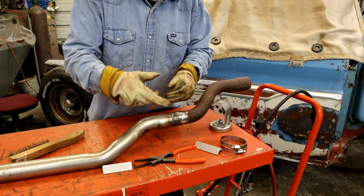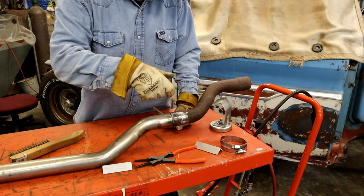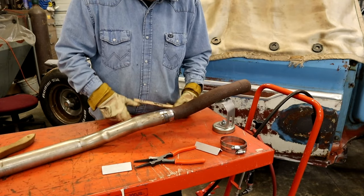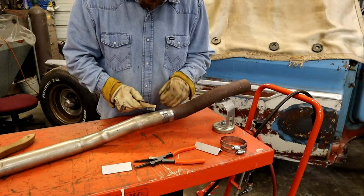But the good thing about this trigger weld, this zap, zap, for a beginner, it gives you time to reset yourself as you go around. And like I said, after you get more comfortable welding, you can just burn it. We're going to do this real time here so you can see if I mess it up or not. It has a pretty tight gap.